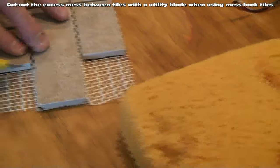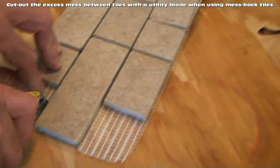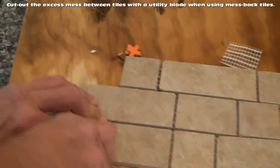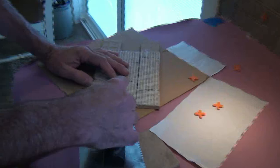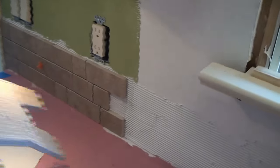The spacer just keeps us on our mark. When I get this extra netting here, I would cut that extra mesh out of my way. I've got a nice three-quarter board here and a retractable utility blade — cut it right off. I'm not cutting on top of the counter, I've got a piece of cardboard on top of the brand new counter. Where I've got double mesh, I'll add just a tad more mastic so I know I'm definitely hitting that spot underneath.